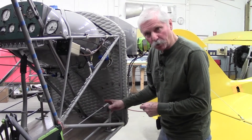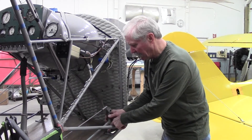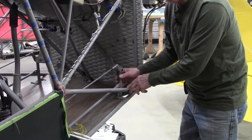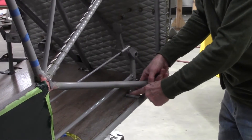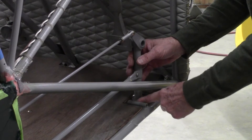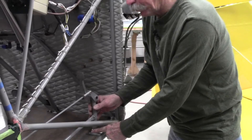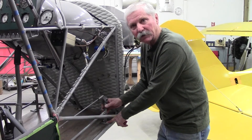The other item on the control system is the rudder pedals. They are susceptible to wear down at the base, so you'll get a small amount of side movement. This amount of movement here is more than acceptable and pretty typical. But they can get loose — there are two filister head screws that anchor the little caps on these things, and those can be tightened up. Check to make sure that you don't have excessive side movement to them.